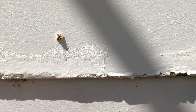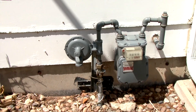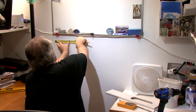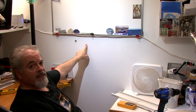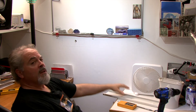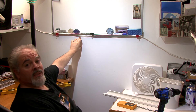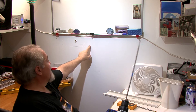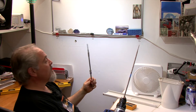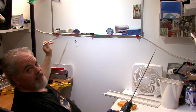I can see where this hole came out on the outside — that's going to provide plenty of room for the outside cover. Now with this traced out, I can see the size of the hole I need to cut to sink this into. It's also the exterior measurement for the duct box that I'm going to build. Next I'm going to drill holes in the four corners, and that way I can use my long bit and drill through to determine exactly where I need to cut on the outside.